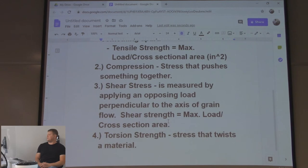It's very weak. Usually we do it for weld testing, but you have to neck it down so far. I mean, it's a quarter of an inch by the time you get it necked down on a weld to where you can actually pull it. And there are, in the codes, certain neck sizes for doing tensile pulls, so you can't neck it down. They make it big enough so that you have to meet the code.